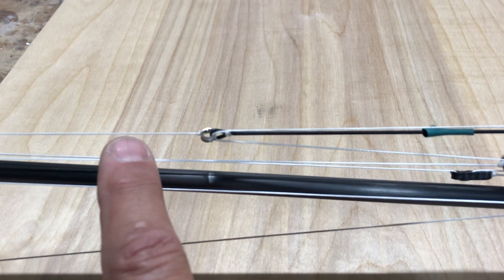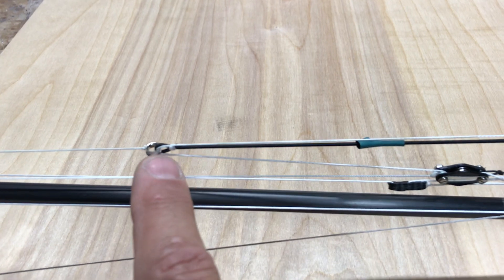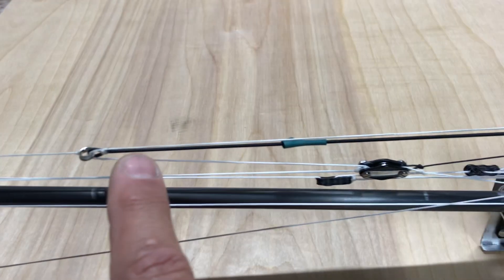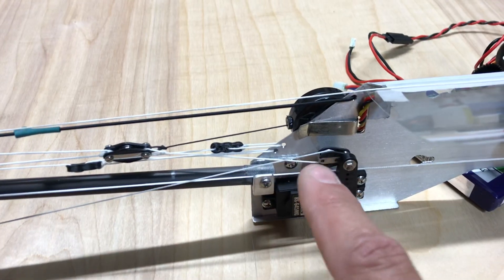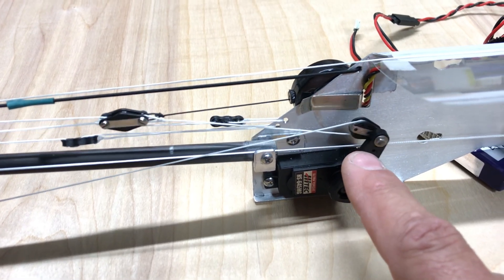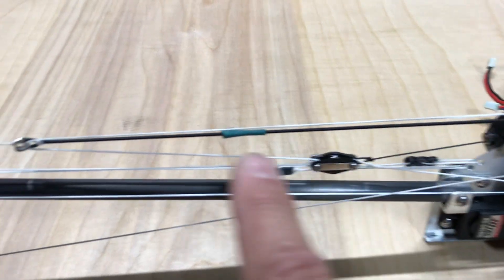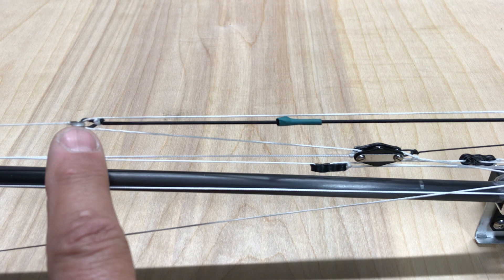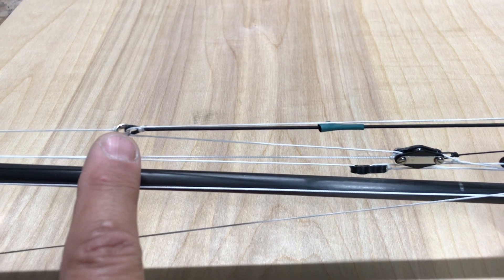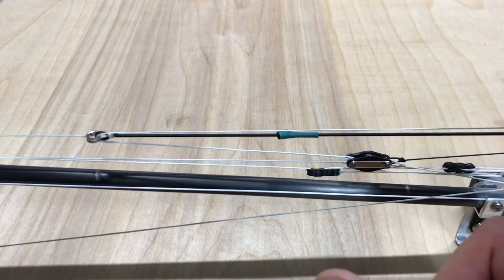The trick is that if you move the ring forward, the main sail's dead point — meaning where it stops sheeting — goes further aft, meaning the main boom stops further aft and doesn't go quite as far out. If you move the ring forward to the left, the main stops sooner; if you move it aft, the main stops later. This allows the main boom to stop just before the lower shrouds.